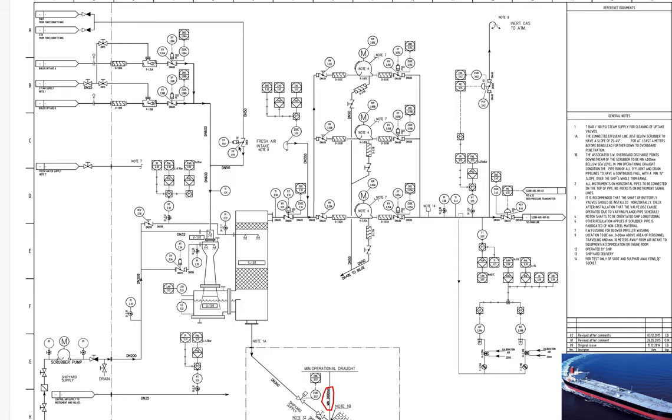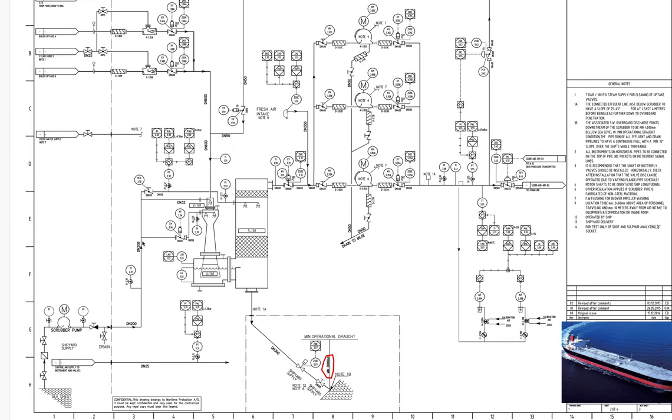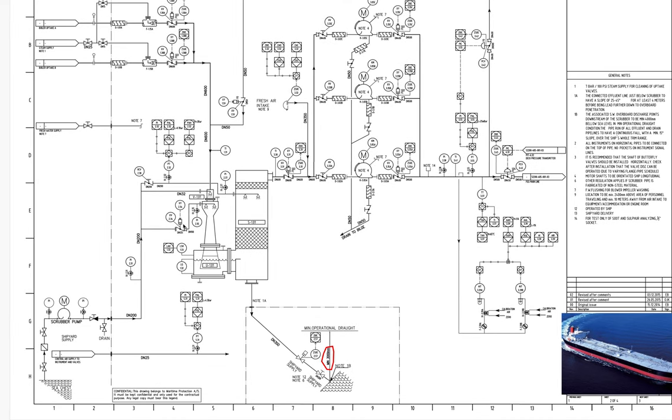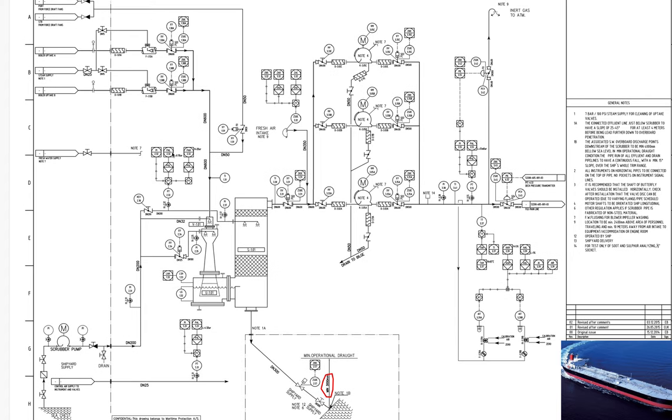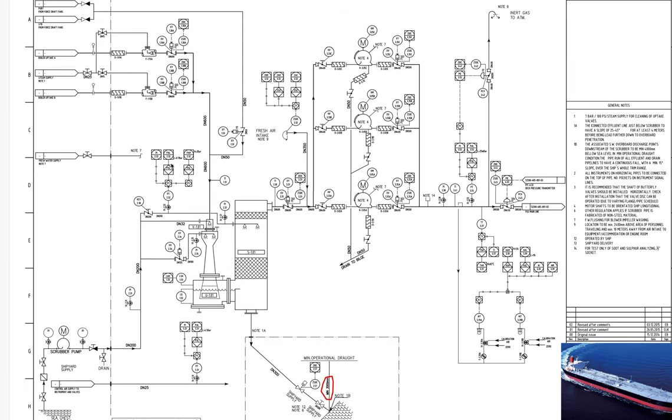Also, when our scrubber pump is not working — which is located here — our scrubber pump will suction from the sea chest. The sea chest will be below here, as you can see there are filters which are necessary for cleaning. Our pump sends the water here, and the water will enter here. There are some nozzles, a valve activated by the system, and also a valve which sends water to the scrubber. We have some alarms and local pressure indicators, pressure alarms with a special high alarm — all the parameters will be received from this line.